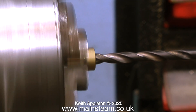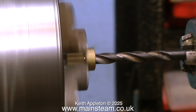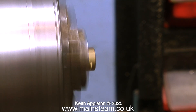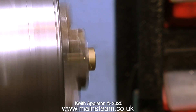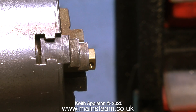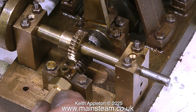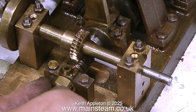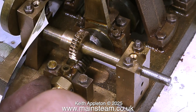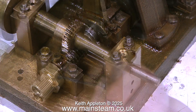In the lathe, lightly clamped in the chuck, is the brass fitting which is part of the universal joint. The hole in the middle isn't the correct size so I'm using a drill which is one imperial size less than quarter of an inch to drill a hole through it. Then to get the finished accurate size I'm using a reamer. After slowly reaming the hole in the brass fitting it's a perfect fit on the crankshaft. I'm estimating how much end float I need to allow — only a tiny amount is required — so tighten the grub screw and that's it for this part of the job.